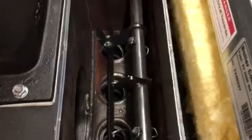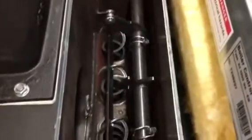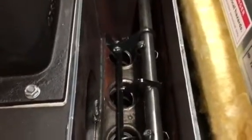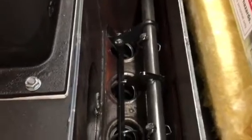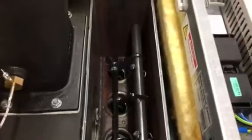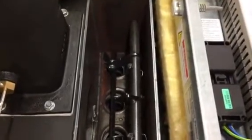On the side of the boiler you'll see a sweeper handle. This handle is connected to the Turbulator system. Every time the boiler is loaded, a few sweeps of that handle lift the Turbulator up and down, scraping the ash off the heat exchange tubes. The Turbulators increase efficiency on their own, but the additional scraping function keeps those tubes clean and in most cases enables the operator not to have to scrape the boiler tubes down with a brush, which is a really nice feature.